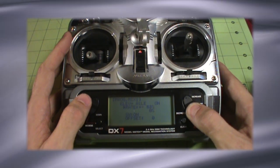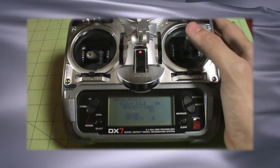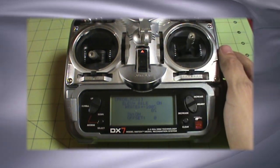All right, so now I'm at negative, and that's just on the up movement. We'll move back over and move the stick up — and guess what? They're now both moving the proper way. So that's taking elevator movement and mapping that same output to my aileron servo. That's what the elevator-to-aileron mixing is all about.